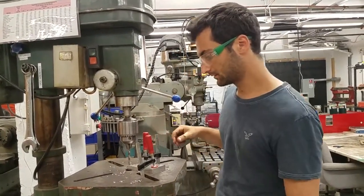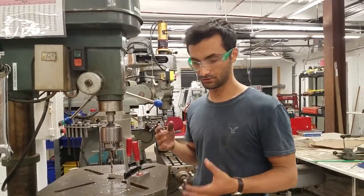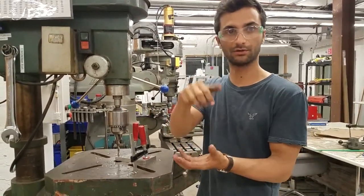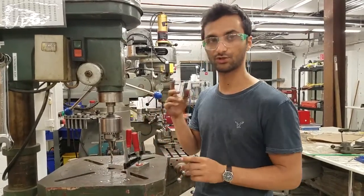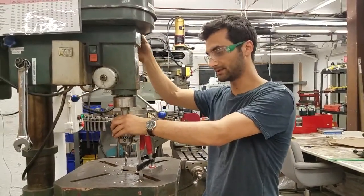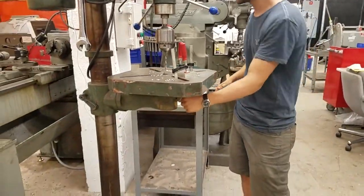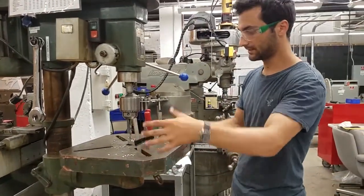That's the deal. When using different sizes, make sure you're paying attention to the speeds you're cutting at and that the work piece is well clamped. You can also use the drill press for tapping — clamp the piece and use the quill to keep your tap perfectly straight. You can even remove the pulley and turn it by hand so the tap pulls itself in straight. You can also tilt the whole table by loosening the wrench and bolt underneath.